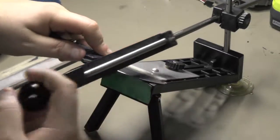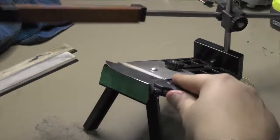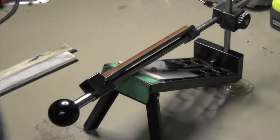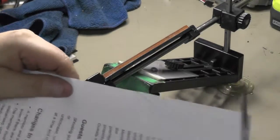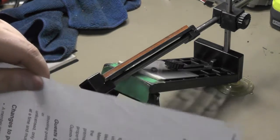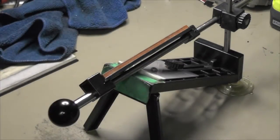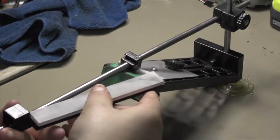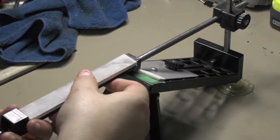So there we go, we're going to go down to like 5 again now. I bet you we took out that little tooth and edge we had on there. Let's keep you in the frame here. Too low of a grit still, probably. It's kind of there still. I can push cut now, though. So anyways, that's 800. I'm going to go to 1,000 now, and then I'm going to go to 1,500. Well, what my stones classify as 1,000, 1,500.